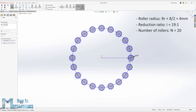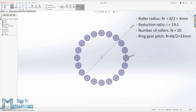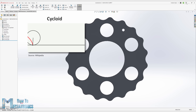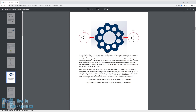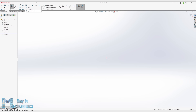I drew a sketch with 20 rollers of 8 millimeters diameter around a circle. According to these two input parameters I was able to determine the minimum size of the ring gear pitch diameter. This value, together with the eccentricity value — which should be smaller than half of the roller diameter — make up the four main input parameters used for generating the shape of the cycloidal discs. The cycloidal disc profile comes from a cycloid, which is a curve traced by a point as it rolls along a straight line without slipping, or more accurately its variation, the epitrochoid — a curve traced by a point rolling on the circumference of a circle at a distance from the center of the exterior circle. These parametric equations can be found in a document written by Omar Yonis for the SolidWorks Education blog.